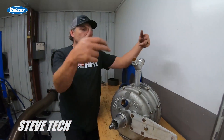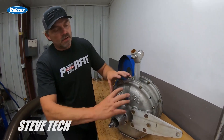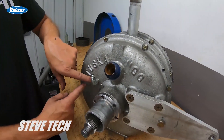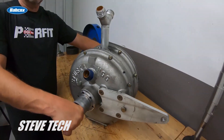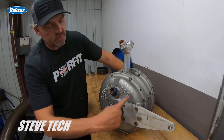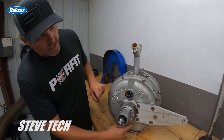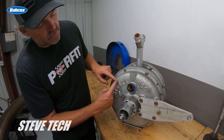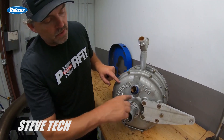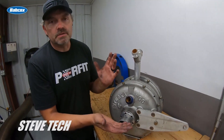We've made this bigger internally, so water goes all the way around the impeller, enters close to the center, spins around, and goes out. You have to have a vent on the back side. This vent is now directional, so this absorber is only one direction because I've changed the venting. The rotation goes this direction, so water comes in here, builds up pressure all the way around, and by the time it comes around it goes to the outside hard due to centrifugal force. This little area is just a vent - there's no water here, tons of water over here.